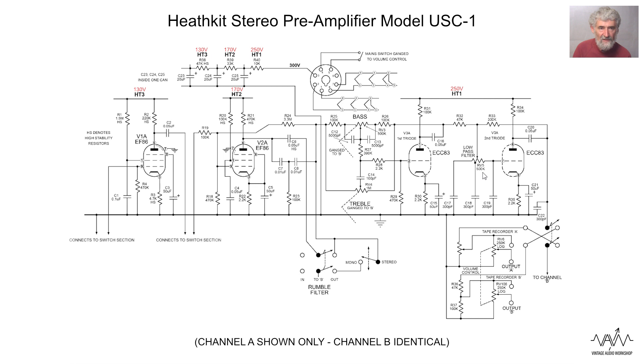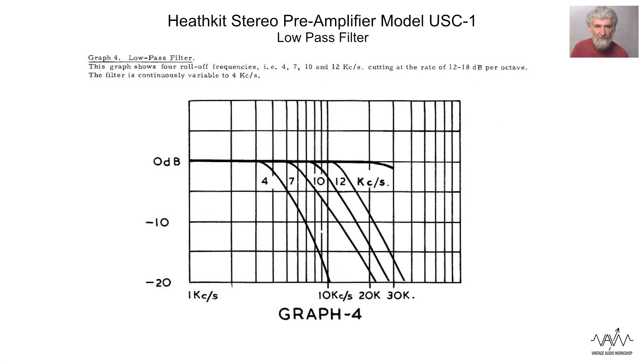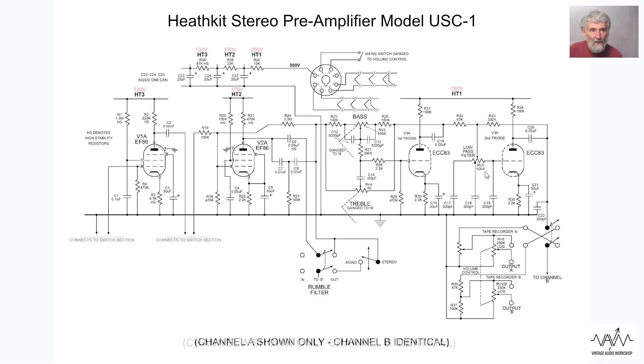Another difference is that as I pointed out in the mono unit, it simply had a switch low pass filter - a noise filter. In this circuit however, one has a pot, so one has the choice of the slope of the filter - in other words, how harshly it works. On a good recording you would not want to use it at all as it restricts the high frequencies. On something noisy, or if you're playing 78 records which are intrinsically noisy because shellac is intrinsically noisy and the frequency range is very restricted, you would want to put this on with maximum slope. It's not a passive control because there's negative feedback feeding into it, so the 6 dB per octave per stage of a simple RC filter is sharpened up a lot.